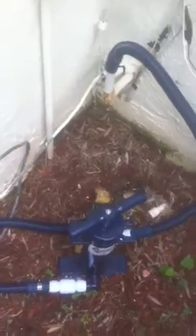By simply lifting up on the pump, just like you would a bicycle pump, pull up and pull down — you can see the water coming out of the drain line. Pump it a few times until you know you've got the clog out and you're done. The Mighty Pump is sucking out the drain from outside the home. It's very quick and easy. Any water that's in the air conditioner drain pan and in the line that's clogged will flush its way out of the line onto your ground.